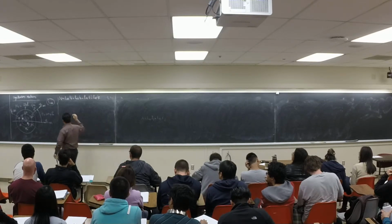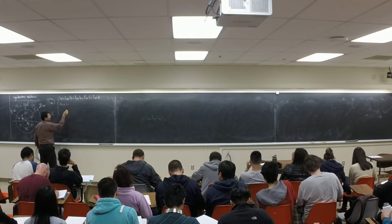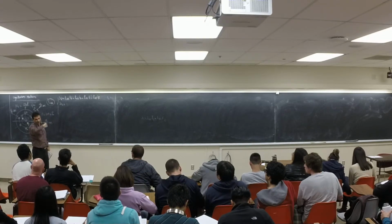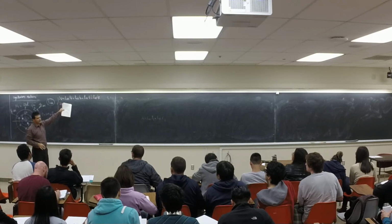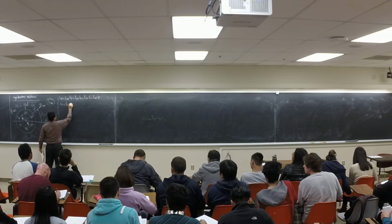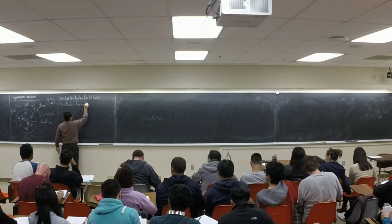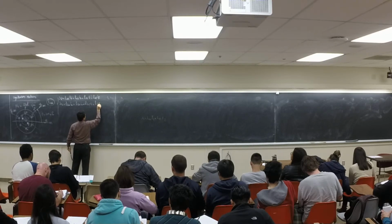So how about lambda B? I'm going to write it quickly. It's going to be LBA, IA, but because these systems are linear, LAB and LBA are equal. LBC, LCB, LCA are all equal. All of them are equal. So I'm going to use only LAB. LAB, IA, plus LBB, IB, plus LBC, IC, plus LBF, IF.